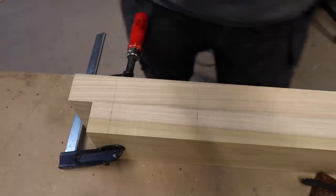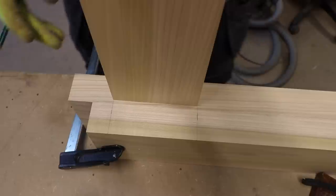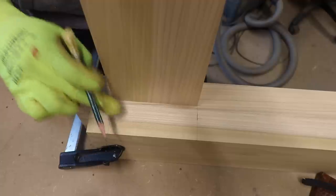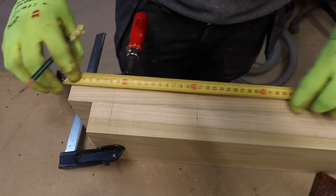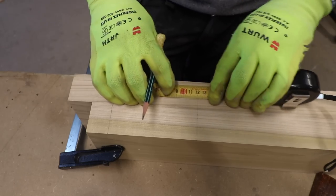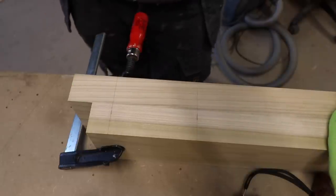If you grab it, you can see where that's going to go in. I've actually made the top rail slightly oversized in the thicknesser, and it's going to give me a bit of room to cut that down afterwards, but that's the finish size and that's the finish dimension that we're working to. So we're going to break this tenon up now into the tenon and then the wedge room, or where the haunch will be. Because we've got a panel in this door, we're going to need to use a setback, because the panel is going to be in line with where the mortise was going to go.